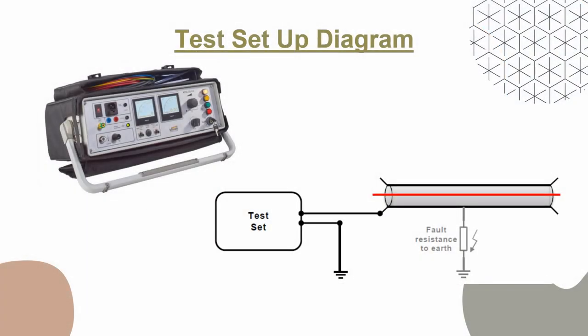It is important to verify the cable has been installed appropriately. As the cables are generally laid in trench or in conduit systems, it can be difficult to inspect the cable for physical damage that may have occurred during installation. This is when a sheath integrity test should be performed, giving us a good baseline to compare to after the cable has been installed.